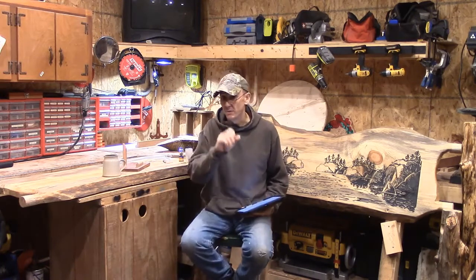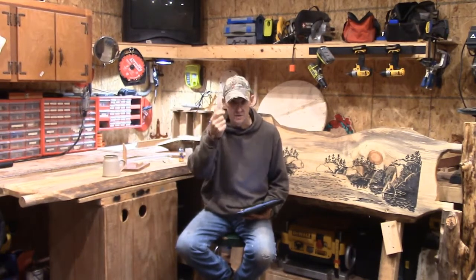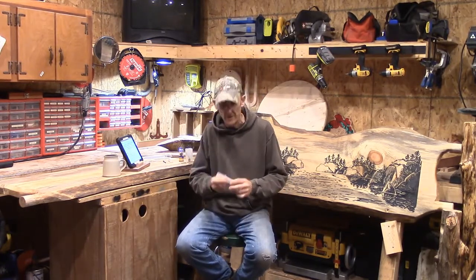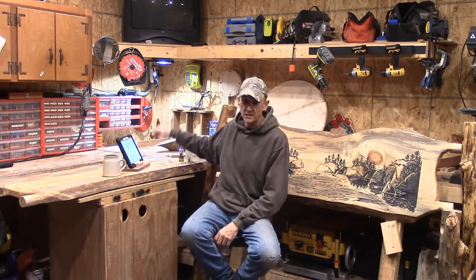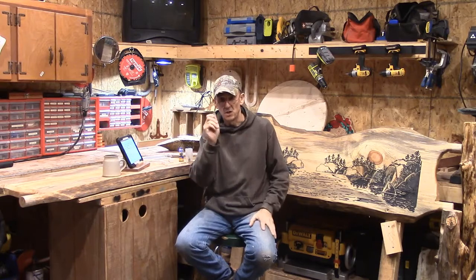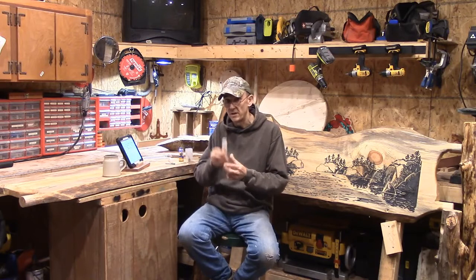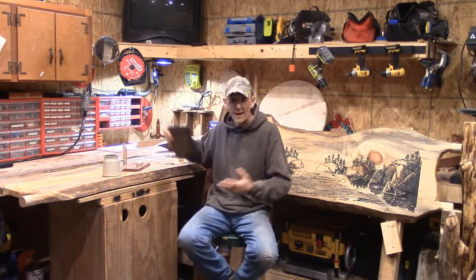Storage — you've spent good money on your bits and they come in little plastic cases. This is my 90-degree V-bit with a quarter-inch shank. When bits come in the mail, I write the date on them with a Sharpie. I do not let them float around loosely in a drawer. End mills come hot-dipped in a coating to protect the cutting edges — as long as the dip is on them I'll let them roll around in the drawer, but once I peel it off they go into a case. When bits are dead and I throw them out, I save the cases.